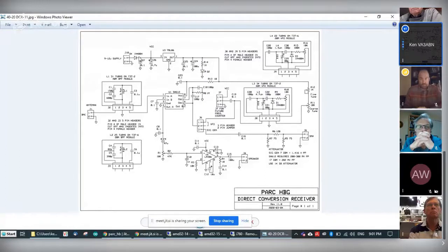So what we're doing is feeding 6 volts to everything. It's running on the 612, and it's feeding. This is the VFO here. You can see the capacitor here, the toroid. We have a reverse bias diode to vary the capacitance. And here we have a band limit set potentiometer. And over here is rough coarse tuning and fine tuning. This whole scheme here works very, very well, except for the drift part.